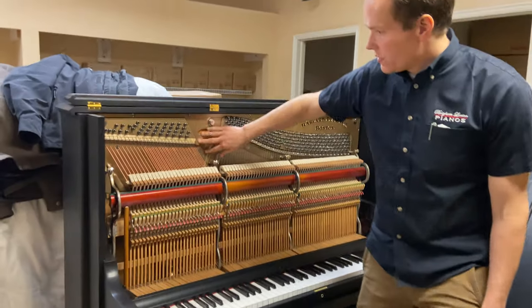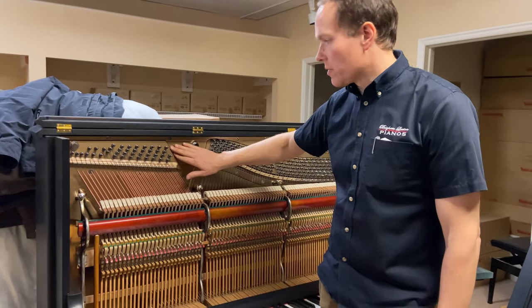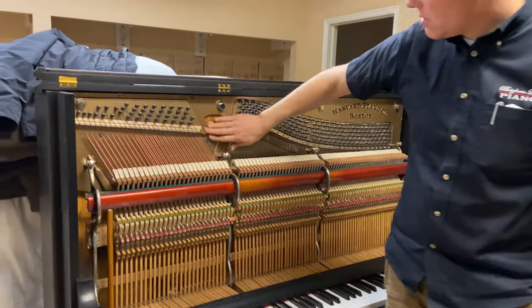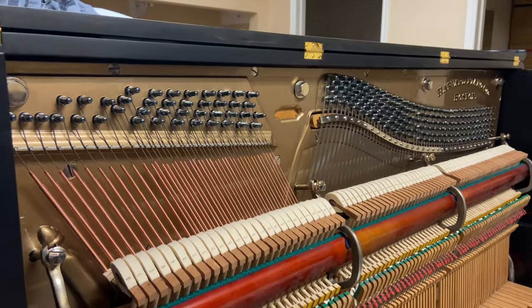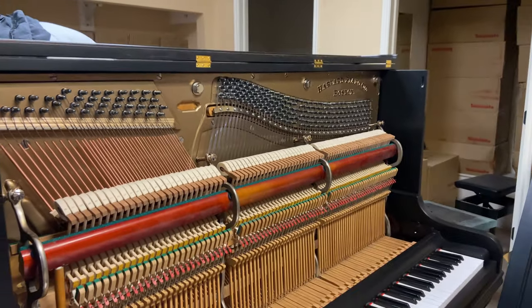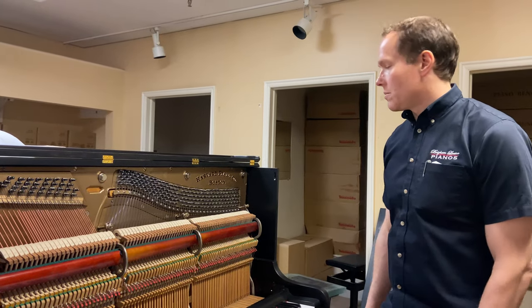Here we have the plate. We took the plate out and refinished it, touched up all of the rough parts, and sanded it all down — made it smooth. Cast iron actually sands fairly easily. You can drill through it, sand it, bondo it, make it super smooth, and put on this beautiful glossy smooth automotive paint. These bolts and screws — we have a special way of polishing those, getting them also super smooth. It's just a series of sanding, all the way up to super high grits and polishing.